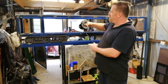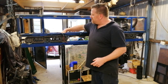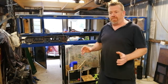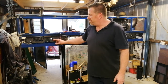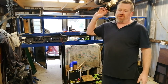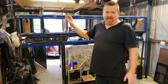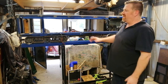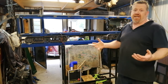So I want to turn around and somehow be able to mount this in here to drive this wheel and hopefully this wheel. I know it's not ideal, like most people will set up a power bogey where it will at least have a chain drive between two wheels, but you got to remember that this is 2.1 meters in length. I've got a unit, which is the head unit, which I can then turn around and put my power bogies in that set if needed, and just have this unit freewheeling with all the generators and batteries associated with it equipped in this unit here. But that's yet to be decided.